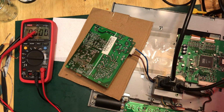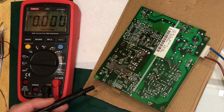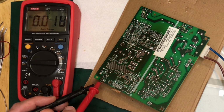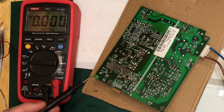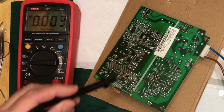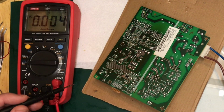Okay, the power's on, so we should have 240 volts running into this, so I'm going to try and be a little bit careful. And I don't actually know where ground is on this board. Just for inspection, this hole here appears to be attached to this plate, so maybe this is ground. So let's just try measuring across this capacitor. Nothing. I want to stay away from the high voltage side. I presume that's what this dividing line is down here. This would be the primary side. This is the sort of not the primary. This is the high voltage side. This should, I would have thought, be the logic level side.